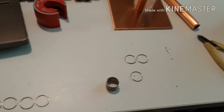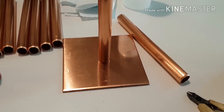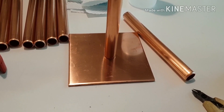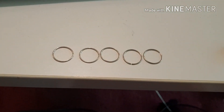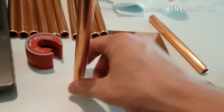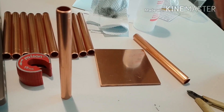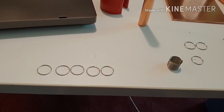I've bought some really good plumber's flux to make sure the corrosion gets burned off during the soldering process. I want the solder joints to look as even as possible, so my plan is to make little rings of solder and slide two rings on the end of each pipe. I'll make a cardboard spacer to hold the pipes at the right spacing, then heat the plate from the underside with a blowtorch to melt the flux and solder.